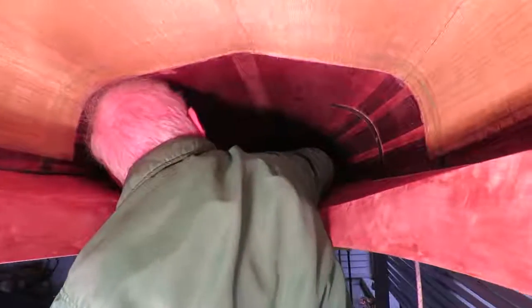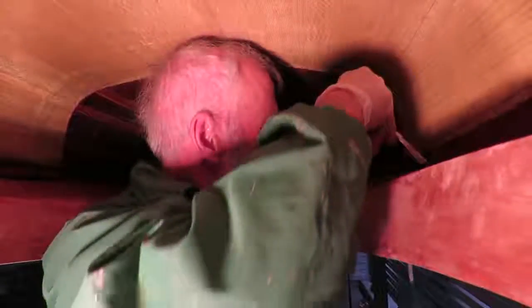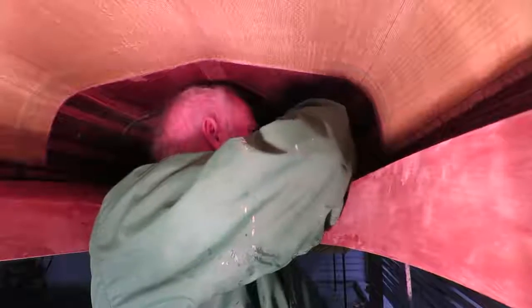Okay, and then we'll coat the side everywhere as far forwards as it'll reach again, and we'll go all the way back to the seat rest. Yeah, a little close in here. But don't go wild with the epoxy on this edge, because any excess epoxy is just going to run down across the deck on the inside, and it won't really add any strength or have any use. So a little bit moderate on the epoxy here. We'll be doing a thickened fillet along here though, and that'll give it lots of strength.